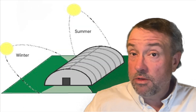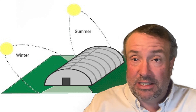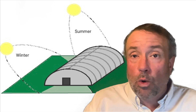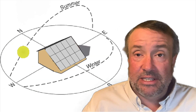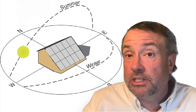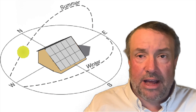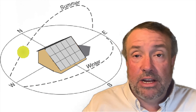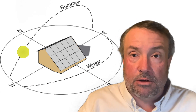The first thing you'll notice about a solar greenhouse is its east-west orientation. They tend to be long and not very wide, taking advantage of the fact that in northern climates — northern United States, Canada, northern Europe, even northern China — in winter, the sun isn't directly overhead; it's quite far down in the southern sky. To get sun all day long, you orient your greenhouse so that light accesses it from the south, with the rectangle facing east-west.